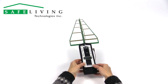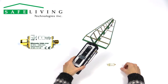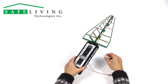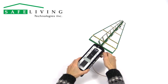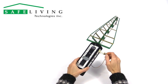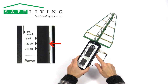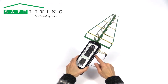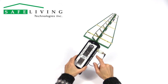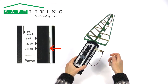If the display is still showing only a 1 when measuring on the 19.99 milliwatts per square meter scale, then attach the included DG20-G10 attenuator: power off the meter, disconnect the antenna, attach the attenuator to the meter, connect the antenna to the attenuator, and change the external adapter switch to the minus 20 dB position. When any external adapter is properly connected, it will have a green light. If you are measuring in areas of little radiation less than a few microwatts per square meter, attach the HV10 preamplifier and set the external adapter switch to the plus 10 dB position.